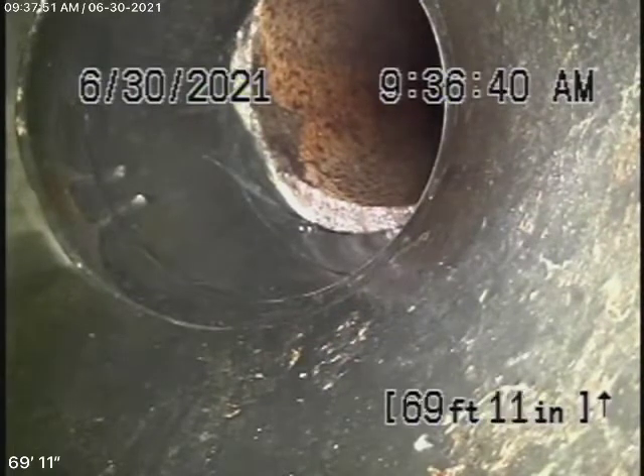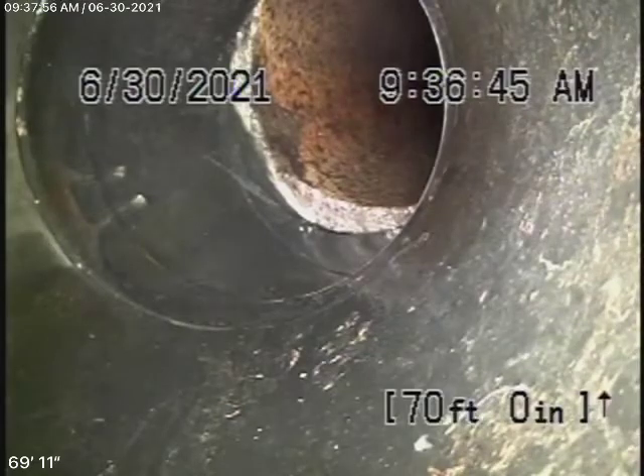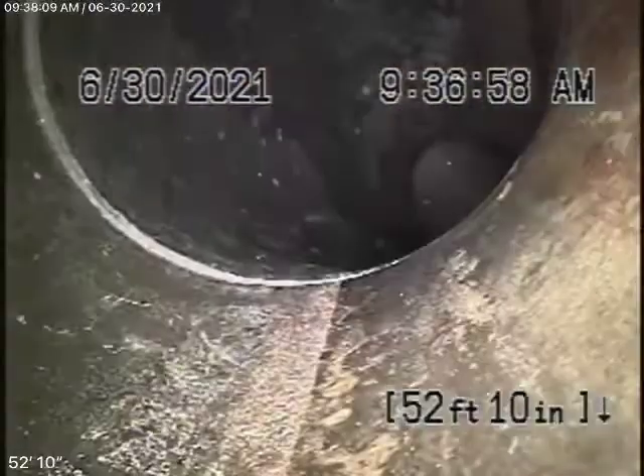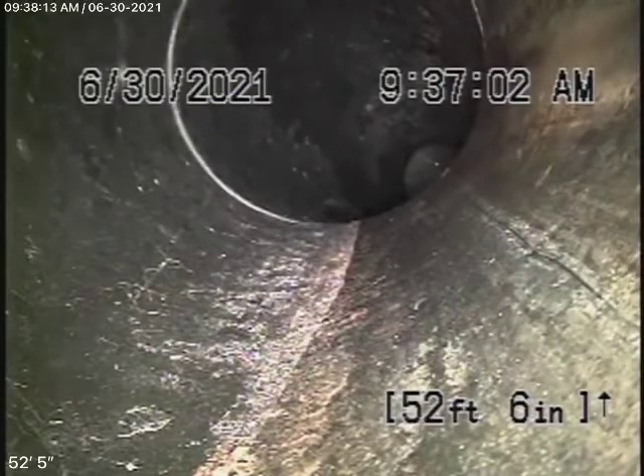As of today, remember it has a very good grade going downhill. Then we come back to ABS plastic, which starts coming all the way up the hill — all in good condition. There is another clean-out right over there, located just in the corner of the property. If you ever need to hydrojet the line, that's where you would do it from. Coming across the top, all ABS plastic, all in good condition.